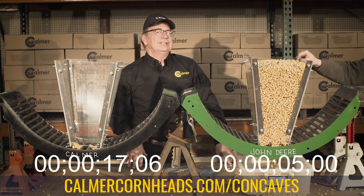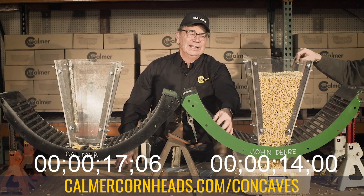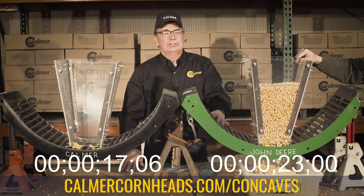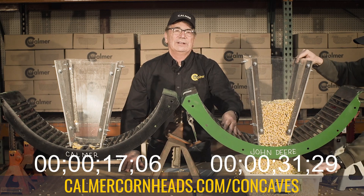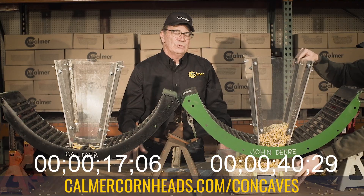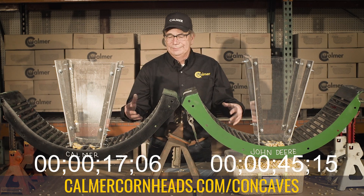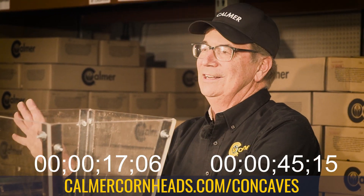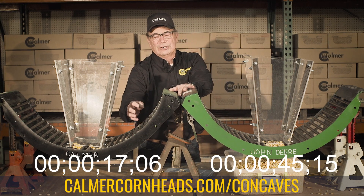Obviously you can tell it's just not wanting to flow through there. It's because these wet kernels bridge against each other on these narrow round bars. We realize the rotor will be moving and the 32 miles an hour will help — but this corn doesn't have any cobs, husks, leaves, or anything mixed in, and you can see what a difficult time we're having getting the 25% moisture corn to drop through. If the corn stays in the chamber, the rotor's going to keep grinding it up, and that's what creates cracked grain. Done — 45 seconds. Over here we were 17 seconds, over there 45 seconds. Just a little enhancement in that round bar made all the difference in the world. We believe John Deere's design is the problem because it's too narrow, and we believe ours is the solution to ground kernels by simply enhancing the round bars.